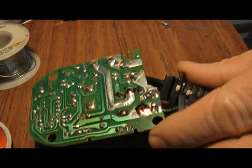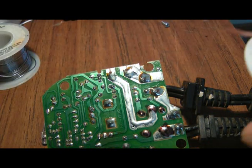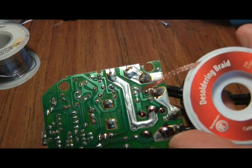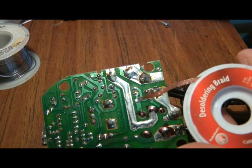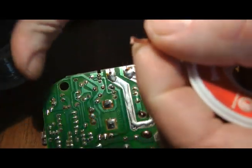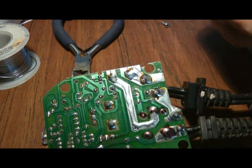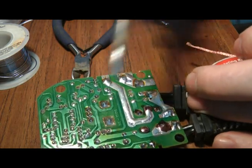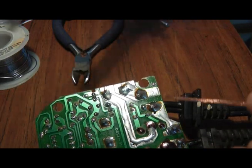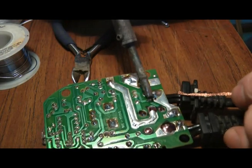What we'll be doing here is — normally most technician people will use a solder sucker. If you don't have one, you can't use it. So I'm going to show you how to do this with just soldering braid — de-soldering braid. It's just a copper wick, really fine braid. The first thing you'll want to know about solder braid is when it gets full — once you've pulled solder into it — you'll have to clip the end of it off every once in a while. It almost looks like a braid you'd put on a bow for a present or something. What we're going to be doing is when we melt the solder on — this is like a 35-watt soldering iron — we melt the solder on this board, and the solder's going to run up into this wick. It wants to be into the copper wick more than it does on the board, so that's how it basically just wicks itself up, channels it up like a sponge.